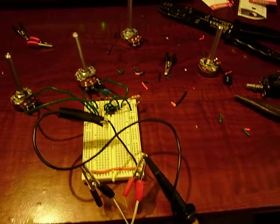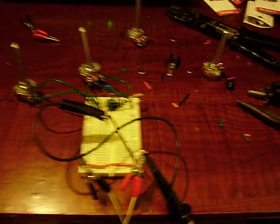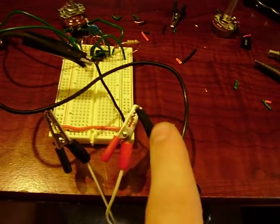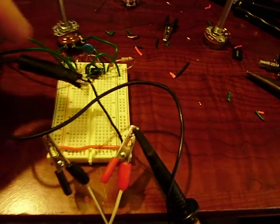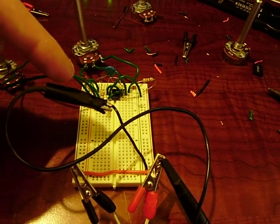I had a little trouble when I was getting this circuit built because I didn't realize that you had to set the O-scope to the ground. As you can see, I have the scope connected to the positive and the other scope connected to the ground rail, which is actually the output of the circuit.